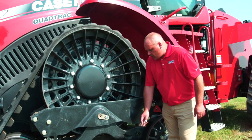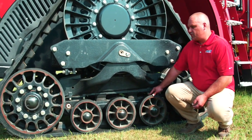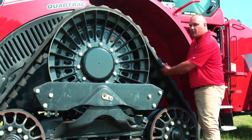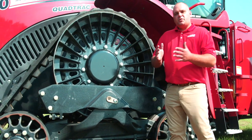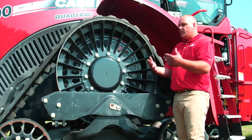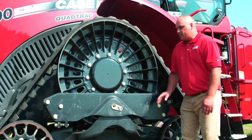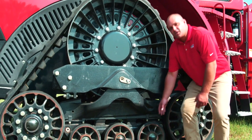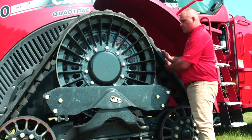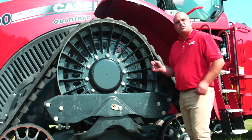What we've done in the past is we had a rubber coating on these roller wheels. We've used rubber on the idler wheels as well, and obviously what's wrapped around this undercarriage is a rubber track. As we start looking at a higher speed capable narrow track, we started finding some fundamentals as it relates to the compounding of rubber — both the use of synthetic rubber here, which gets vulcanized onto the roller wheel itself. We found that any rubber track system is going to generate heat — we call that hysteresis heating — through the expansion and contraction cycles of the rubber.